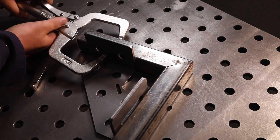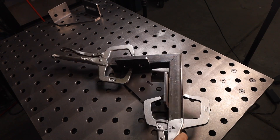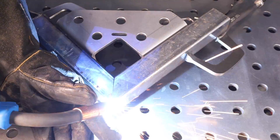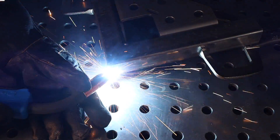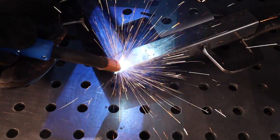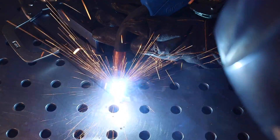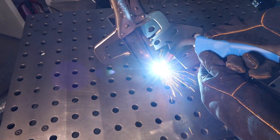I've cut a 45-degree miter joint here and I'm going to clamp it to this square, which will restrain things from moving quite a bit. The sequence in which you weld can make a difference with weld distortion. First, I'll weld the outside corner because that is going to pull least of all. Then I'll weld the sides from the inside to the outside in hopes of opening things up just slightly. Then it'll be locked pretty well in place before I put in the fillet weld, which will pull more than anything. I found that to work pretty well.